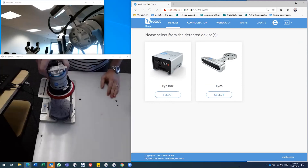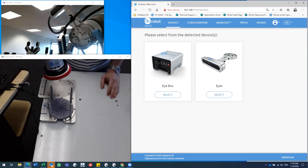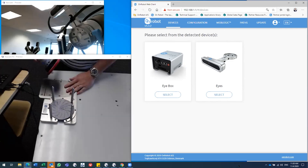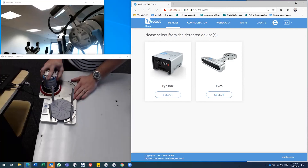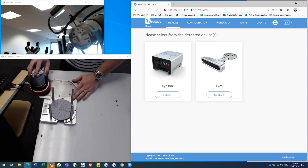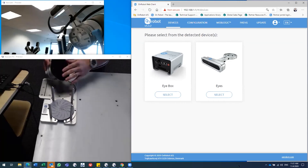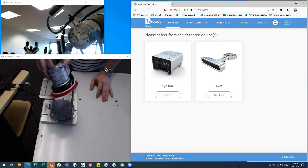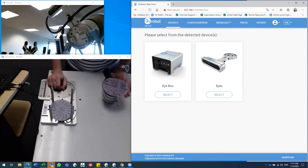As part of the sander's accessory kit, there's a grit changer. It has a cage for holding sanding pads — the robot goes down to attach the pad, performs its sanding operation, then moves to the grit changer position and removes the old pad using a cheese-grater-style design by moving linearly. Grit changers on the market can cost tens of thousands of dollars; this is a very inexpensive yet effective approach, straightforward enough even for an inexperienced operator.